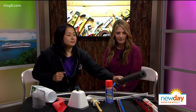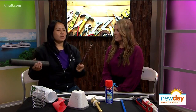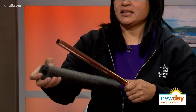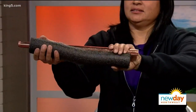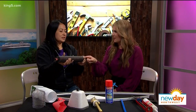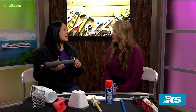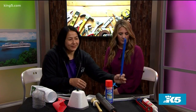Another thing is insulating your pipes. Let's say you have copper pipe in your garage or crawl space — you get pipe insulation from the home store, find the pipes hanging somewhere, and just clip it on. That will insulate your pipe. If your garage is not covered by drywall or insulation, you might be able to see the pipes — if you can see them, cover them up. If you can't see them, don't worry about it — they're insulated in your wall.